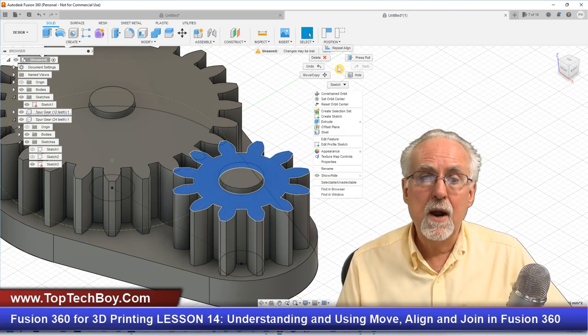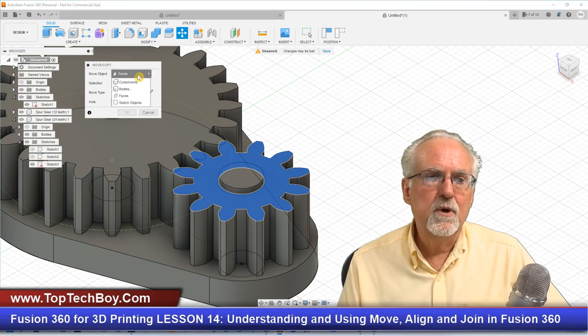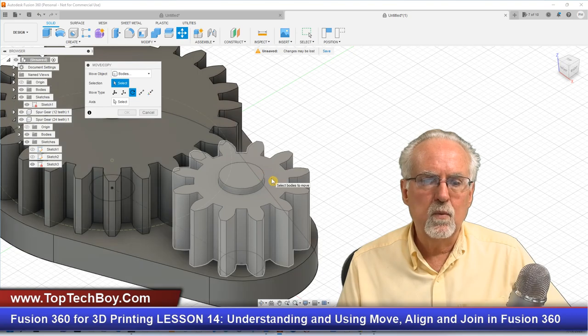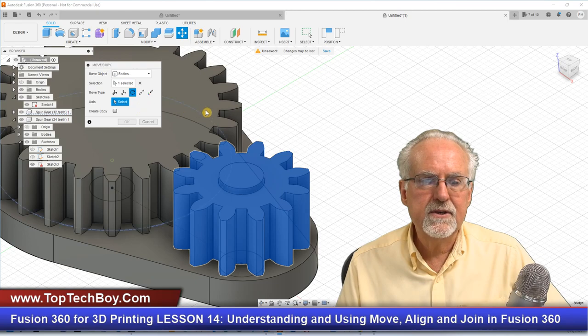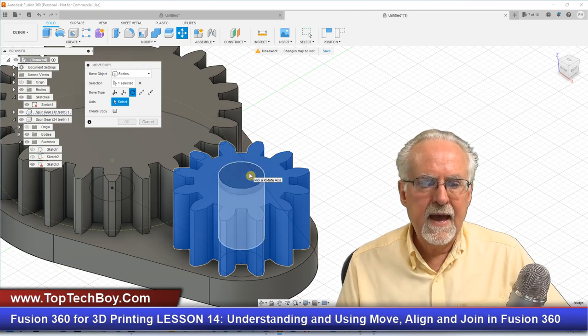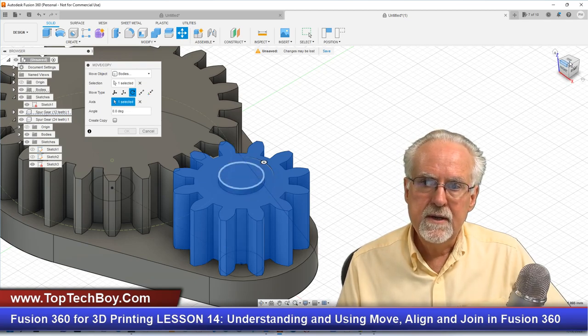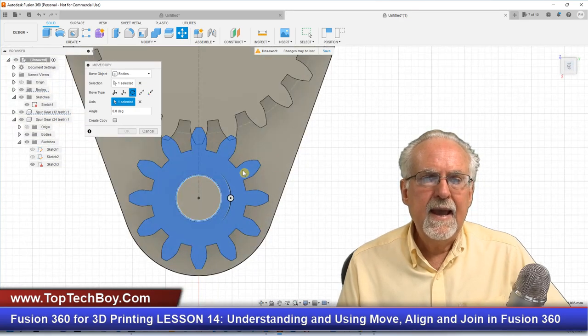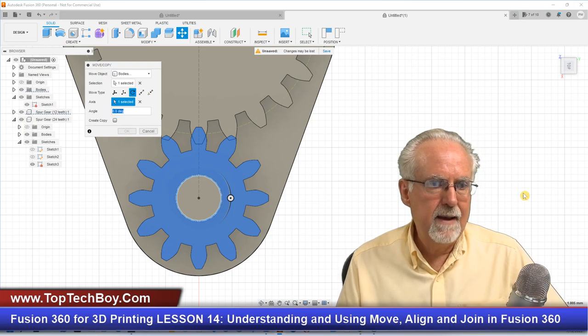So I'm going to come up, right mouse click, and what? Move copy. What do I want to do? I want to do a rotation. I'll do a body because this is a body. I want to rotate this body and then select the axis. So I'll select it. And the way I select the axis, I'm just going to select this circle, and that will be the axis of rotation. I'm going to look from the top, and this freehand, it makes pretty big jumps. And so I'm going to play by just typing it in here.